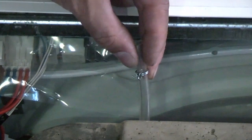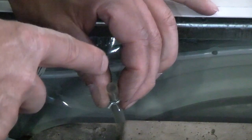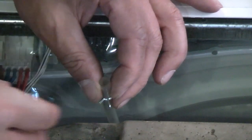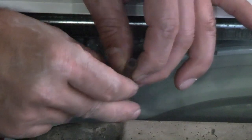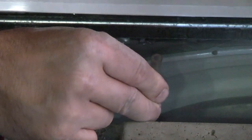If you are having problems that you think are related to the pressure switch, it's always a good idea to blow down that tube to ensure that it's not blocked. You can blow down this quite hard and it won't actually do any damage.